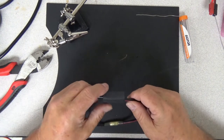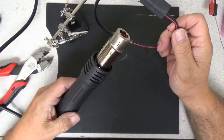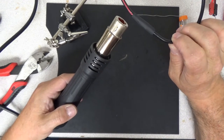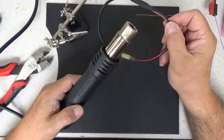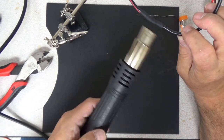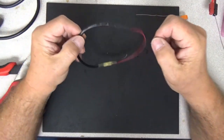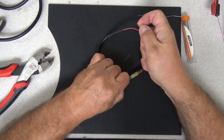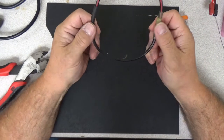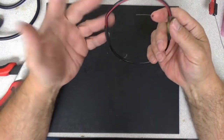We're looking pretty good here. I'm going to slide this over and bring our heat gun up to heat. There we go — see how much that shrinks? That's a nice piece of heat shrink right there. Now let's talk about advantages and disadvantages of these two connections. They're both really strong — they're not coming apart if you pull on them. They're both watertight. The electrical connection on the soldered one is probably a little bit better. That's about the only difference.